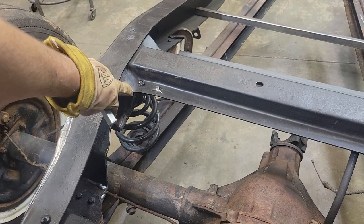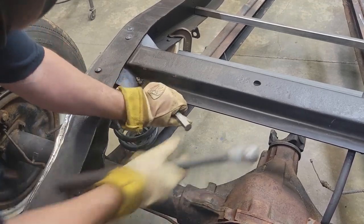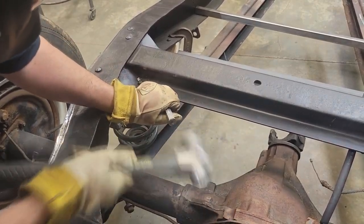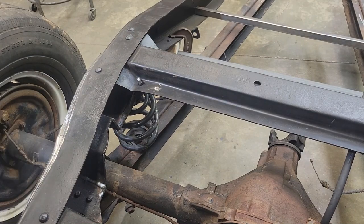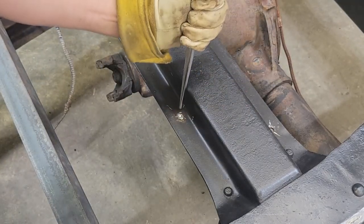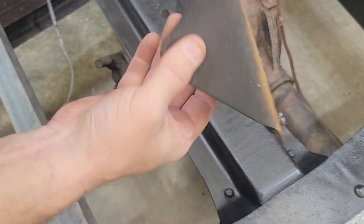You can see it split that side off. We're just gonna knock this off and drive it on out. That one's out. Now we're gonna get our center punch, put it dead in the middle of it, and give it a whack. And that's how you do it the hard way. We'll save this piece and use it for something else later.